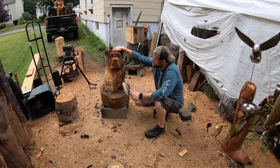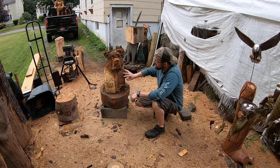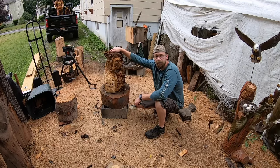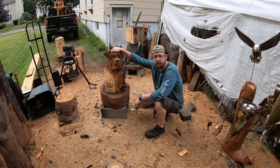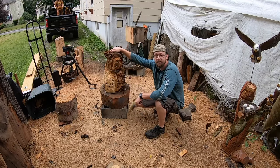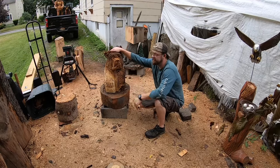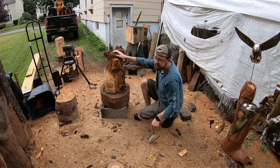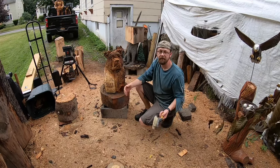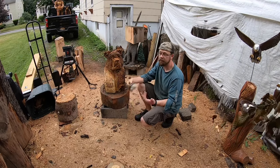Now, as part of this series, for what we're doing is basic carvings, this would be ready for finish. I like to use the Minwax Helmsman oil base, not the acrylic. And you can put a couple coats on by hand or spray it. I like to brush it on and it helps protect your bears. Now, the other thing you could do after you burn it and hit it with the brush is you can paint it black, okay? It'd be ready to paint black and you could do that. But again, that's more money you have to spend.